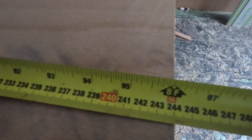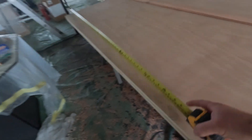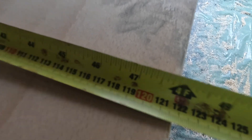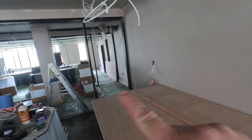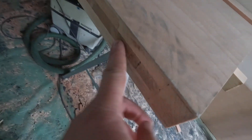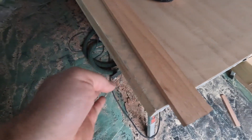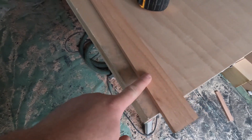Obviously that means it has to be installed properly — we will have to have the fire strips and so on. You can see the door is 244 centimeters by 122 centimeters, so that means we need to cut this down to whatever size we need. If you're not familiar with a blank fire door, they have rough edges, so the edges will have to be covered. In this case we're going to use a hardwood lipping — this one is about 12 millimeters thick.